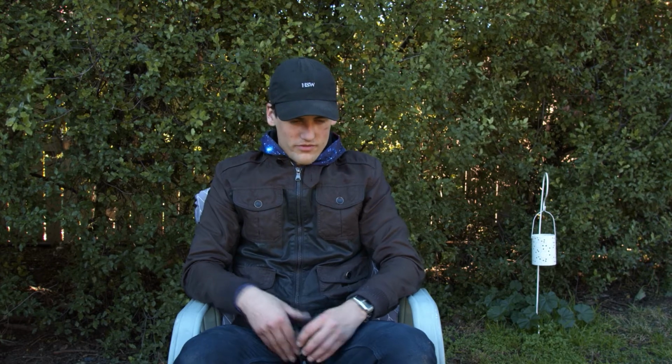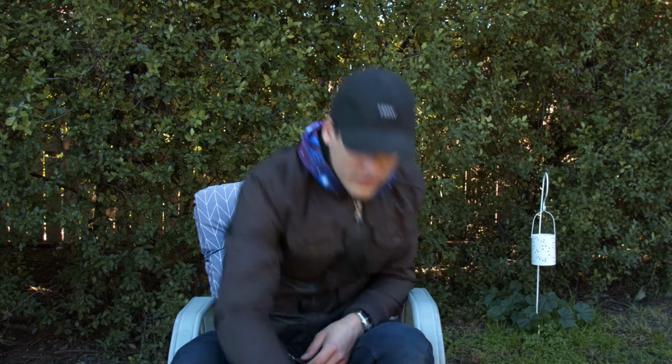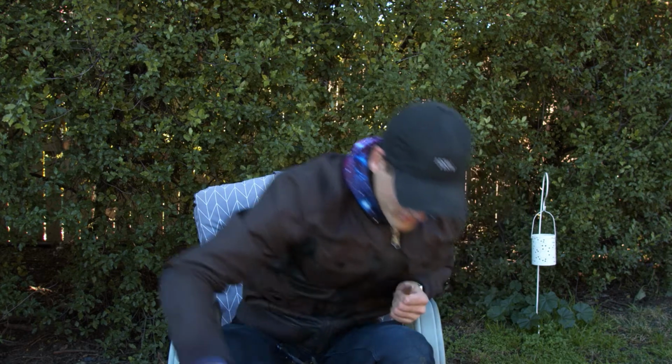Often when these things burn, they turn into a dust and they start piling up at the bottom, blocking up the hole. But this time, I don't know if it's just because I didn't have it burning for as long, they didn't tend to block up the hole, and so the airflow kept really true the whole way through. And so the blockage is one of the factors that could stop your aluminium melting from working or cut the process short.